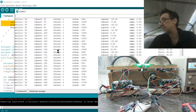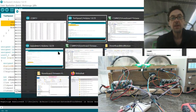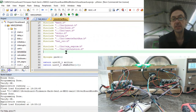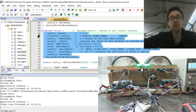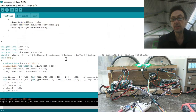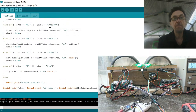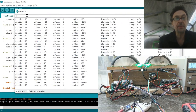I introduced a config on the main remote bus. Now you cannot only send speed commands, you can also send the battery high or low setting. That's in the test serial code. Use 'bh' for battery high or 'bl' for battery low. Go to the console and type 'bl 0' and it should be safe.